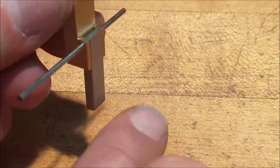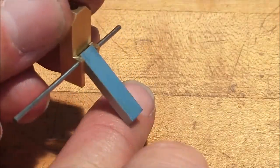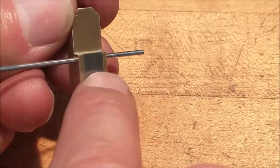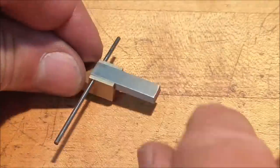As the tool traverses across the part it's under load, and as it comes back it's allowed to drag and then reset for the next cut — never blocks. Let's put the little counter bore in for the tool post, cut it to length, and call this one a wrap.